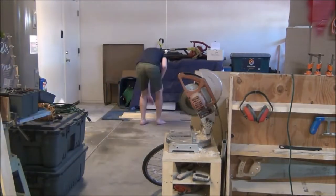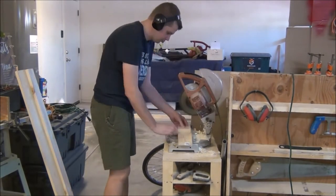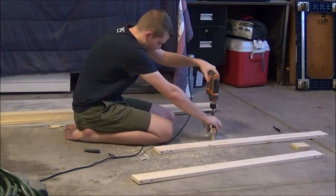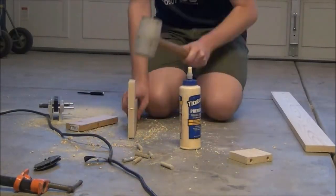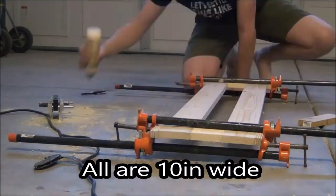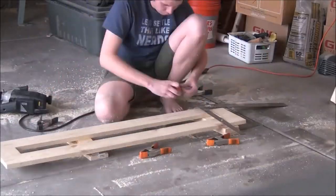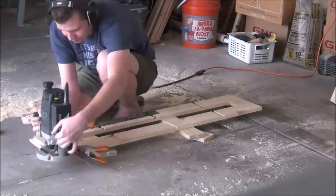With the closet now cleaned out, it is time to begin construction. The first thing I want to build is a shelf that perfectly fits inside the closet to display some of my builds and technical items. I've taken a few 3-inch wide boards and I'm going to build three rectangular frames out of them to serve as legs of the unit. I'm going to make one rectangle 5 feet tall, the second 4 feet, and the last one only 1 foot tall. With all three frames done and the glue dry, I'm going to take my router and plunge a 3/8-inch deep, 3/4-inch wide channel every 12 inches up the frames. And I'm not wearing shoes for this, but you definitely should be.